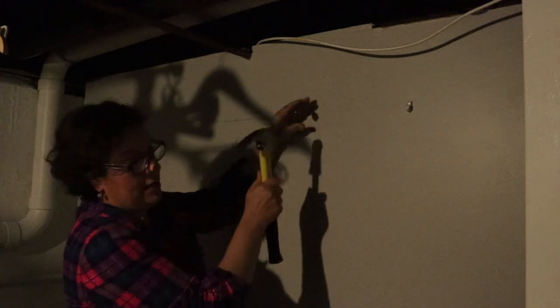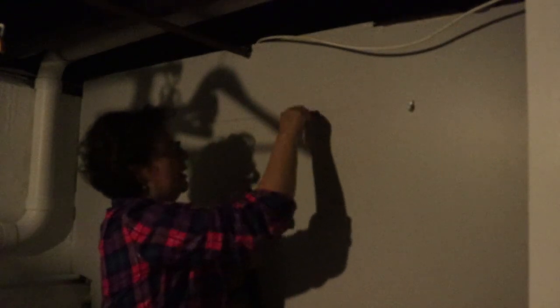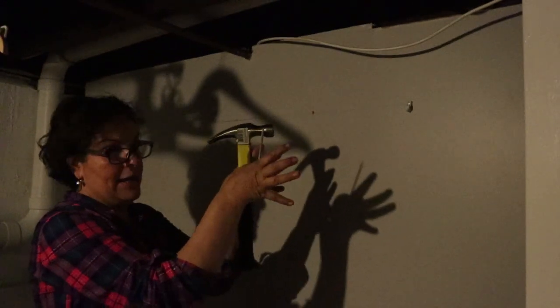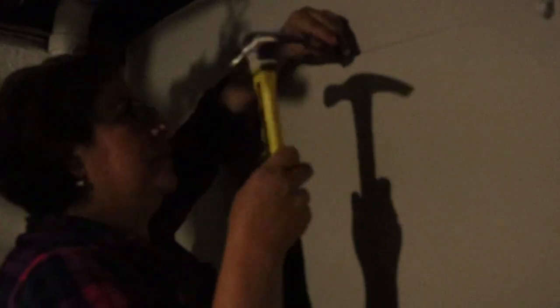Punch a hole like that, then make it a little bit bigger — enough for one of those anchors to go in. These are the butterfly anchors. When you put them in and put that big nail in, they basically open up and cannot pull out, giving you the resistance you need for your shelf to stay against the wall. It's a good thing I'm not on any stud here. So you take your screwdriver, enlarge your hole, get your anchor, put your nail in.